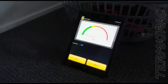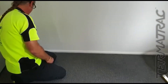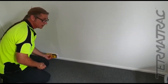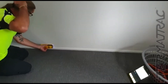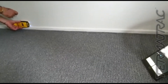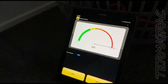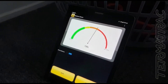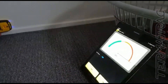Now we're open, so I'm just going to run it across the wall over here and see what sort of figures we're getting. I'm down low, so that's not an unusual figure for where I'm located and time of year. Now we're starting to climb up. So we'll just put a general pencil mark on the wall roughly in this area where it is altering. I'm still going along — that's elevated moisture. Now we're just starting to break off, so just generally speaking, another pencil mark.